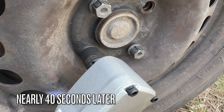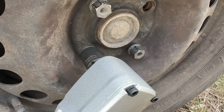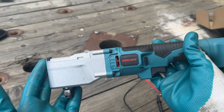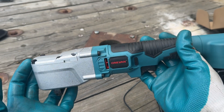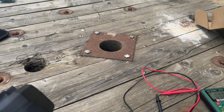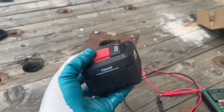It turns out attempting to loosen a 210 newton meter bolt with this right-angle impact wrench is quite the risky business — sometimes it will, sometimes it won't. I'd say it's okay for about 200 newton meters. The one-van right-angle impact wrench sometimes can do 210, sometimes it can't, and long term most probably it won't be able to.